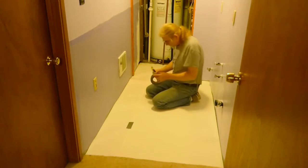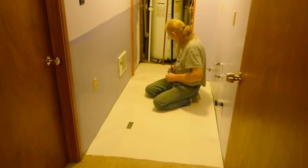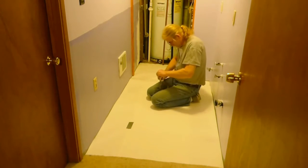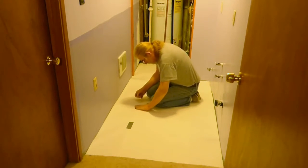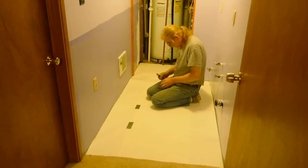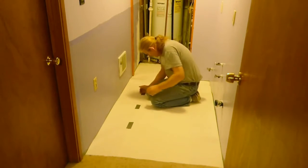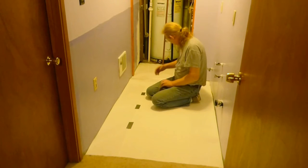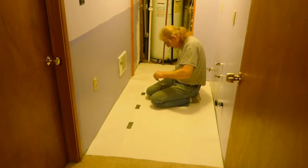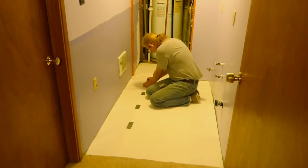And staples are probably okay because this is like a padded type of linoleum, but I found that with the little hard vinyl tiles, any imperfection in the floor, a bump, a dip, a staple will come through, not through the floor, but the vinyl tile will get the same dimple or raise where the staple is, as you walk on it with time.